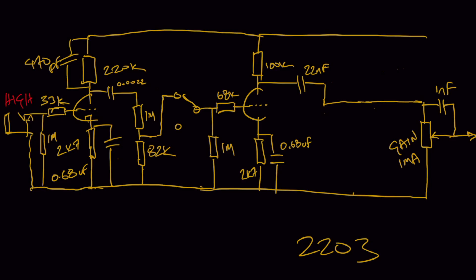This other side — jumping over the ground wire — I want connected to the input jack, because in this design we now have a single jack input into the amp. That's your guitar straight out of the pickup coming in, connecting to both the relay switch and the circuit input.